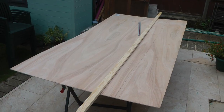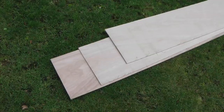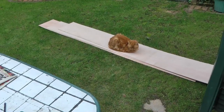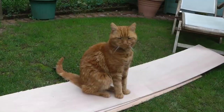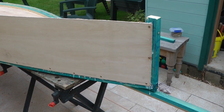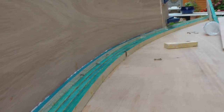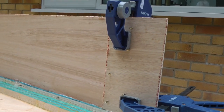Now we're on to the second sheet of plywood — this is 5.5-millimeter plywood from Jewsons, about fifteen pounds a sheet. I cut it up into eleven-inch strips, four of them, and chamfered the ends because they need to fit as they come around the curve against the post. Now we've fitted one of the sides — you can see the chamfered bit at the front so it fits a bigger area — then glue and screw onto that edge. An eight-foot board won't do an eleven-foot boat so you need a little overlapping piece.